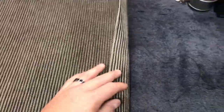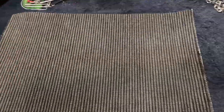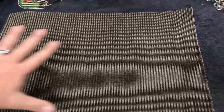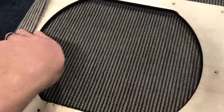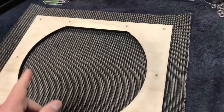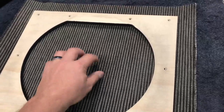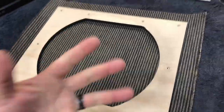I had folded this over to make sure it would fit, and it was actually holding the shape before. After getting it wet - by getting it wet I mean literally just taking a damp cloth or a spray gun and just making it wet. You can kind of see the splotches there - on the back side I got it wet, it's fairly even in color. On the front you can really see where it's wetter in some spots than others. You just want to get it wet and then you can tug it and stretch it a little bit. That allows you to get it stretched over - you fold it over, tack it down, stretch it, and then go back with the heat gun. Once we get this tacked up I won't be able to get it tight enough to be taut, but with a heat gun or hair dryer we'll be able to get this thing almost as tight as a drum.